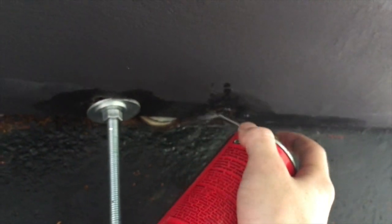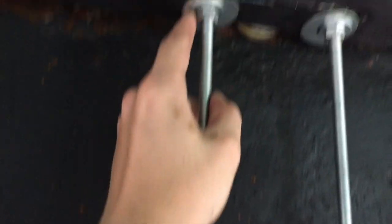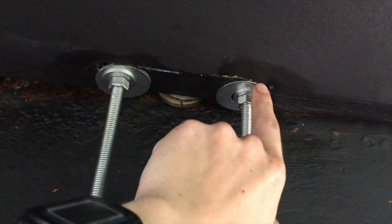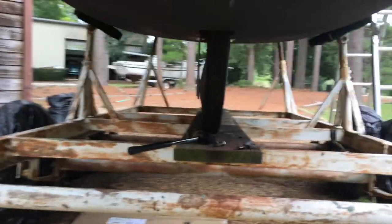This thing's super caked and I painted anti-fouling over it. So I sprayed some screw loose — I'll spray a little more. I sprayed some screw loose to get the fouling a little wet, and then I have this little chisel which is my new favorite tool. I'm going to go around it and just hit it with the back of the mallet, go in a circle, and try to break that free. It'll just take a little work. That's the last one on this side — I already did the other side. When you do your washers, push this in and avoid hitting the outside fiberglass, just go against the bracket here. That's a good idea, as you can see it's on both sides.